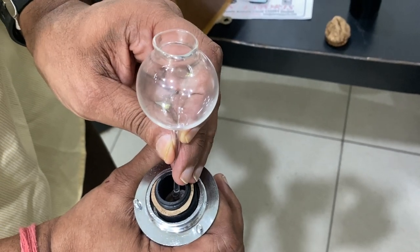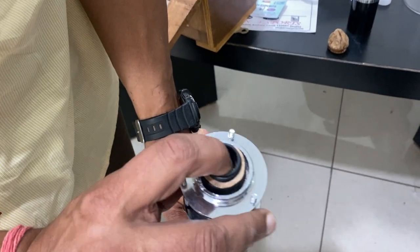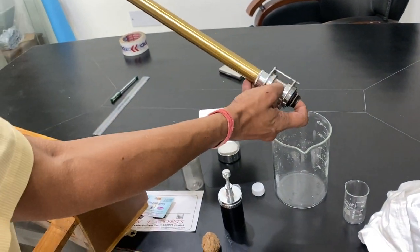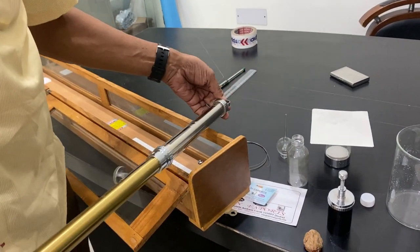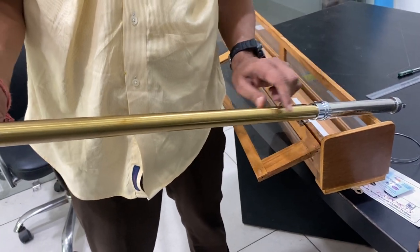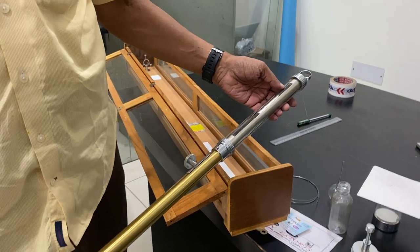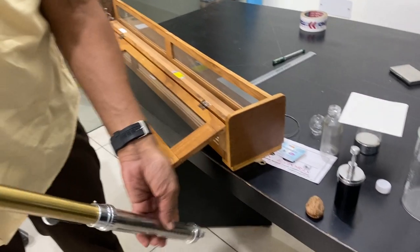When this is completely filled, don't fill it outside. What you can do — you can push your finger here with a thin finger and close this opening. Then you have to take out the mercury from the outer section and move the mercury from one section to another. Slowly the bubbles inside will move — slowly I will put it like this so the air bubble goes up: mercury will go down, air will come up. Once again I will do it. I am just demonstrating how it is to be done.